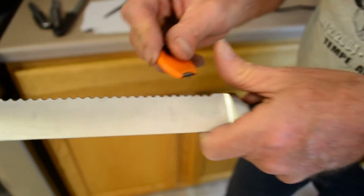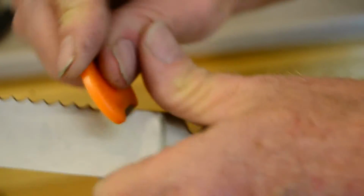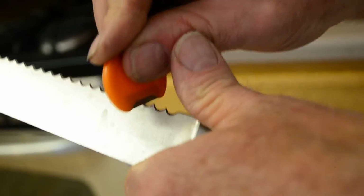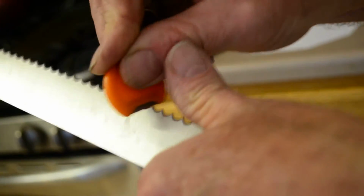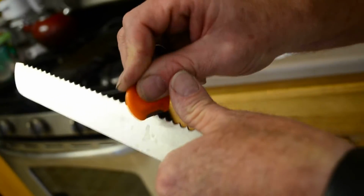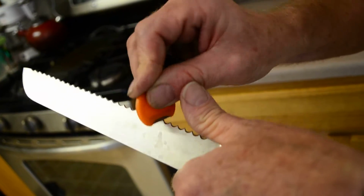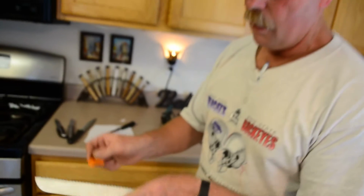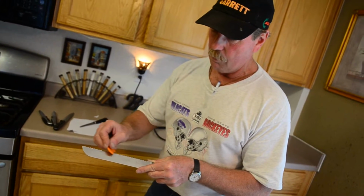We make a pivot out of my thumbs, put the right thumb under the left thumb, come down in here, slide it sideways. When it follows the contour of the grind, it fits perfectly. If you poke at that with a file or a rat tail file or something like that, a diamond impregnated file, none of them fit, so you're going to distort the holes. You're going to go down into the bottom and make it deeper, or you're going to wear the points off if they're too big in diameter. Then we just go along like this. We don't push too hard. We let it work. We don't make it work.